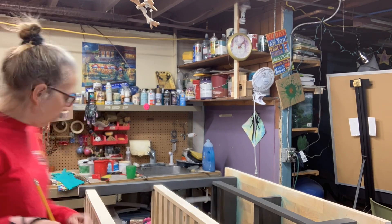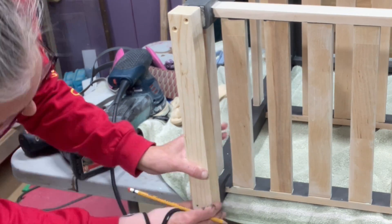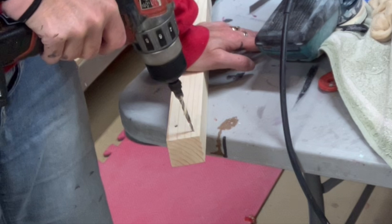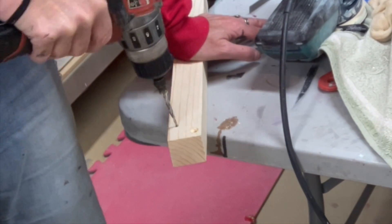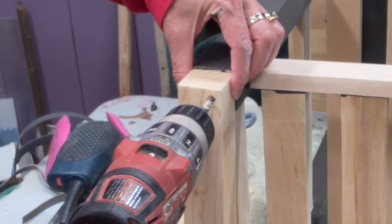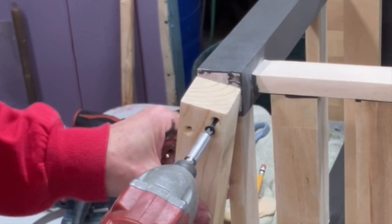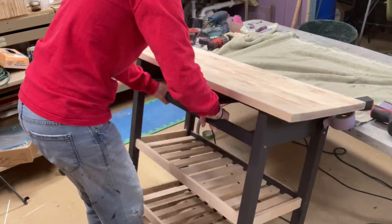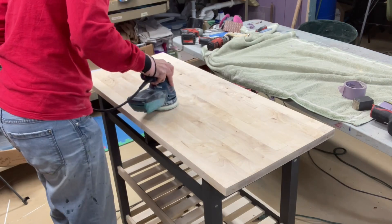I just marked the back legs — I'm going to be cutting those with the jigsaw and then sanding with my orbital sander. Now here I am going to pre-drill. Oh good lord, look at how I'm holding that drill — stop everything. You need to hold that drill straight up and down so that bit isn't crooked. You need to look at your drill bit from the side because it's very hard to see which way your drill bit is going — from above it looks maybe straight up and down but it's not necessarily.